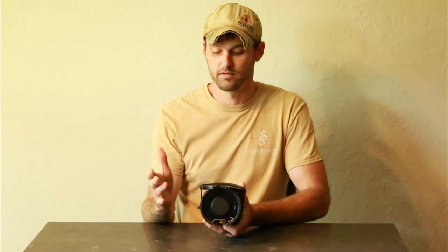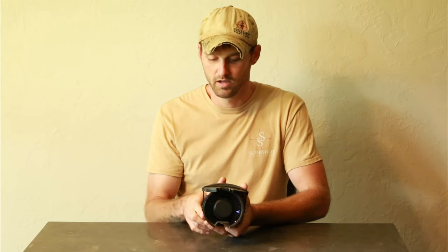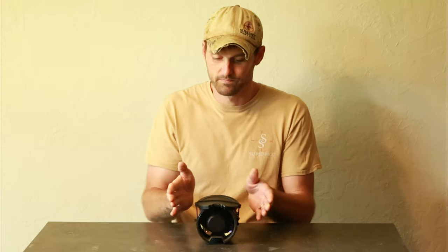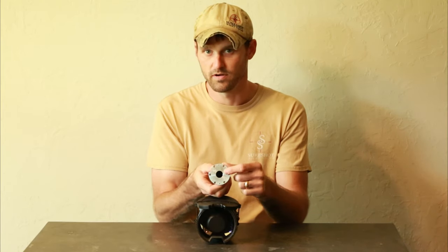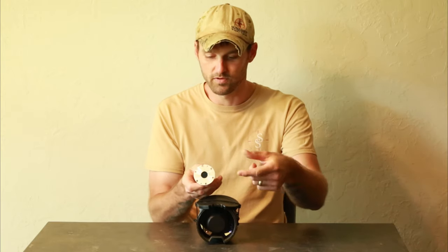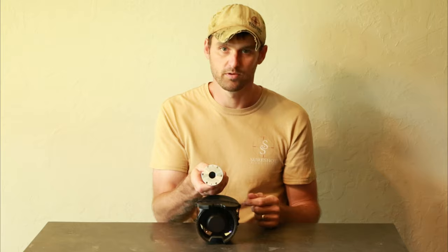Combined with the L3 filmless tube, it's unbelievable. If there's a light photon out there, it's going to find it and send it to your tube. How these cat lenses work — they're basically like a funnel. They take all of the light and funnel it down right to the input screen of your image intensifier, sending it right to the photocathode. This big lens funnels right down to that small black circle you see in the input screen of your image intensifier.